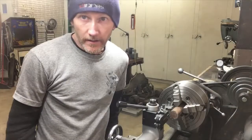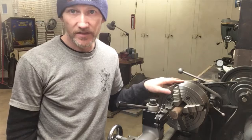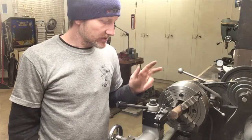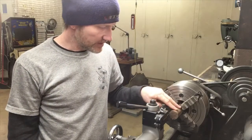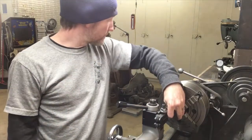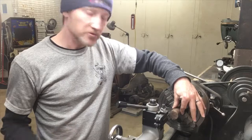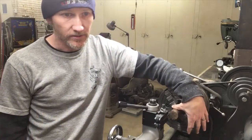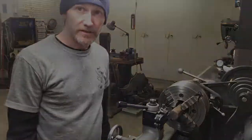So, finally, let's go to the lathe. All right, we're over here at the lathe. I've already got the metal chucked up in here. I didn't show indicating that because my only indicator stand happens to be my camera stand. So I'm basically just going to face it. I'm going to have to turn it down to, I'll double check, but I think it's 1¼ inches OD. Drill in a 5/8 inch hole and then part it off somewhere around 1¾ inches, I think. I only just looked at pictures of it, but it's not really critical. All it has to do is have two little bumps and fit over the piece and have a set screw. So I'm just going to get to it.